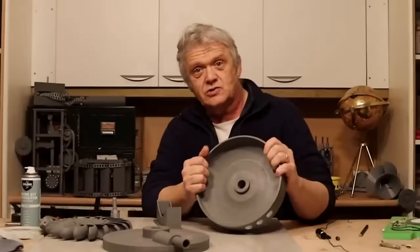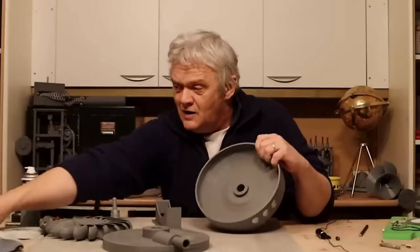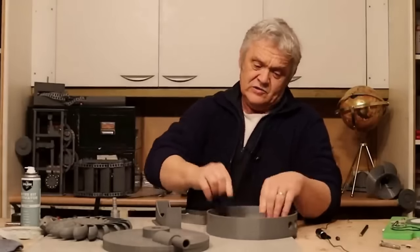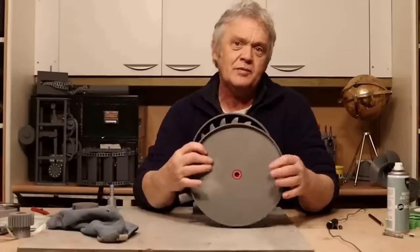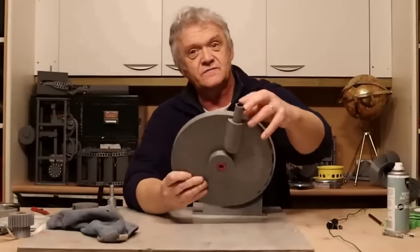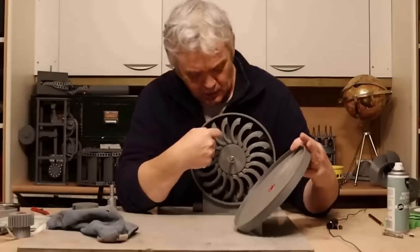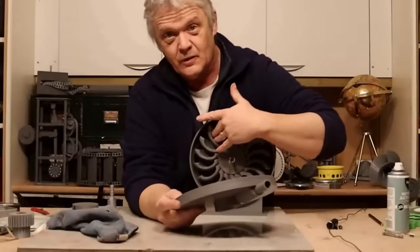These are 608 bearings: 7mm deep, 8mm centre, 22mm wide, taking an 8mm piece of bar. I stuff some bearings in there - one, two, and two in here - then glue the foot on. There's an 8mm washer there as a standard thing - when we press something together, it presses against the inner race of the bearing and allows it to spin freely. Making sure this is pointing upwards, in there you'll see three 2mm holes pointing at 30 degrees into that section. The water gets fed in here, squeezes out through there, and jets over in that direction on the turgo.